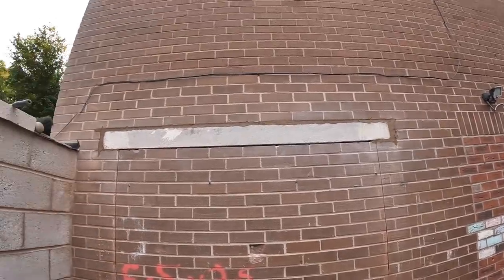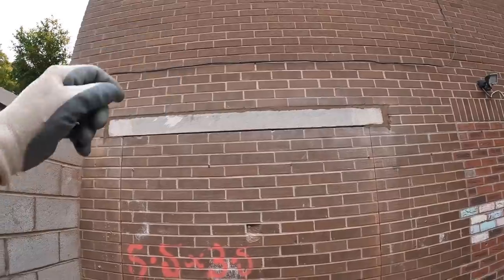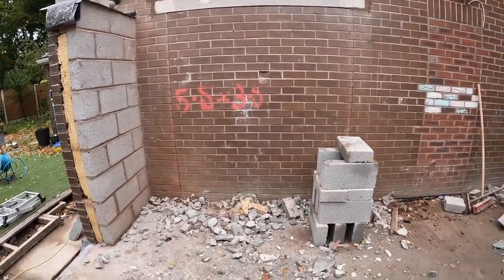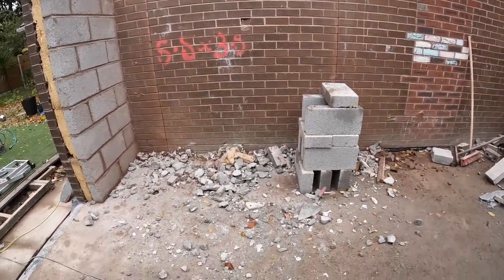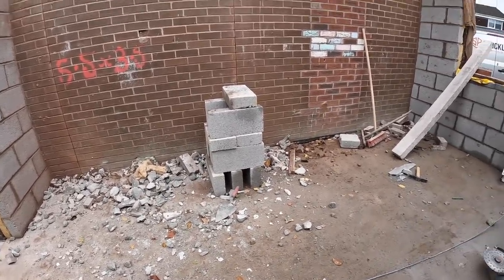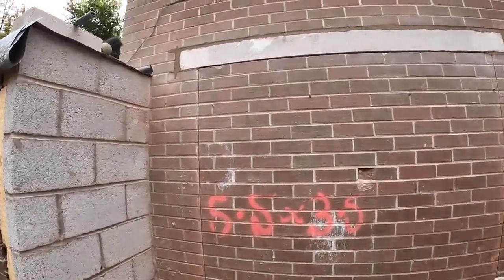It's all in, that is absolutely solid, it's all been pointed in with the tuck pointer, and because I can get to the back side of it, it was all coming out the back, so it's nice and full, and I've just flushed it all up, so that's going nowhere. So yeah, all the rubbish is going in the bag at the front, ready for when the skip comes, and blocks are going in the van onto the next job. So once that's in and up, Alex can crack on with the tidying up, and I'll get on with putting the piecing up and getting it all pointed up.